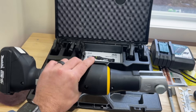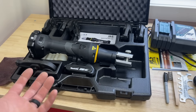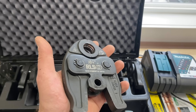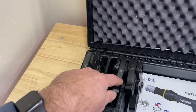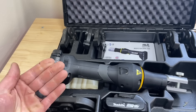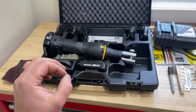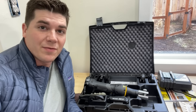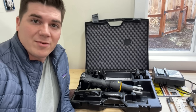Well, it's as easy as that folks — really, really nice tool. This is not for your average DIYer. If you're looking to purchase this tool and you're in the trade, a couple of things to be mindful of: this kit does not come with the three-quarter jaws — I had to purchase those separate. They come with three-eighths, half-inch, five-eighths, seven-eighths, and inch and an eighth, which is really nice. Overall, really nice kit. I think this is going to be a real game-changer in terms of liability — not having a flame in the home. I hope you guys found this video informative. Leave it a like and consider subscribing. Until next time, be safe.